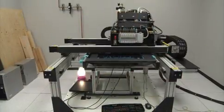Okay, so the next thing we want to talk about was the code part of it, and how simple it is actually to control the robot. When the robot was handed to us, it's, like I said, 2 separate systems. We had a National Instruments for the motors, and then we had the Profibus protocol for the air. So we had 2 totally separate systems that we wanted to control, and we had to talk to them separately.